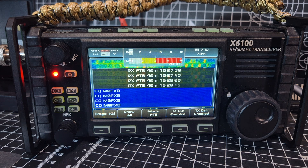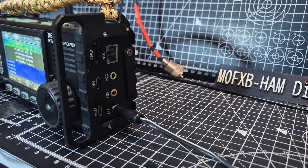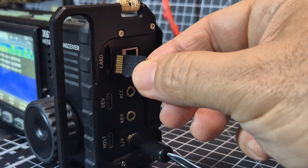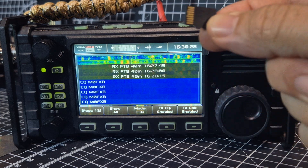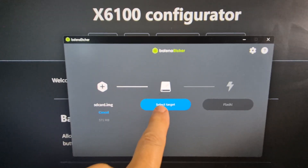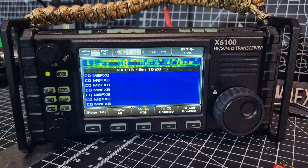To make this work, you just put an image that you can download onto an SD card — a 16 GB card will be plenty. It pops into the side. To get the image on, you use Balena Etcher; it basically transfers the downloaded image onto the device. Just Google Balena Etcher, download it, open it up, select the card, select the image you've downloaded from the link I provided, flash, and wait for it to finish. Then pop the card back in facing forward, turn on the device, and it will boot with this new image.